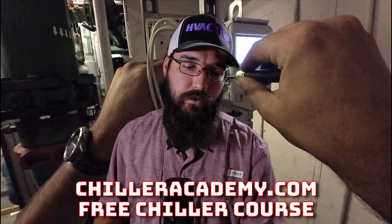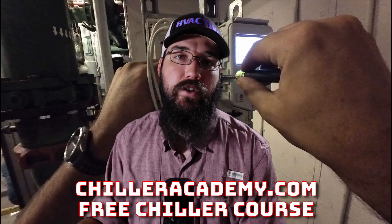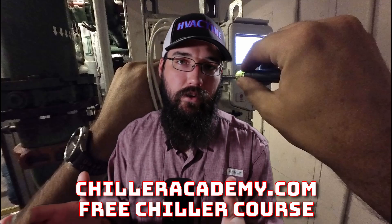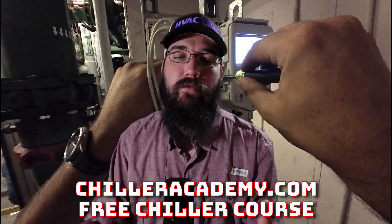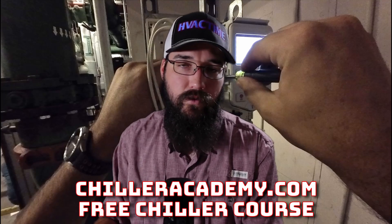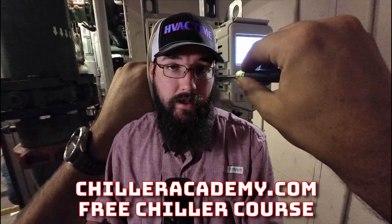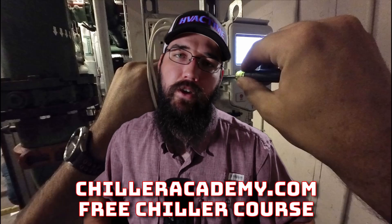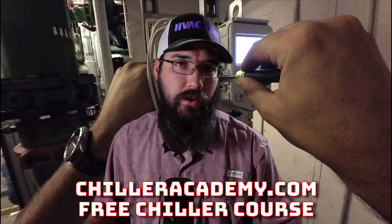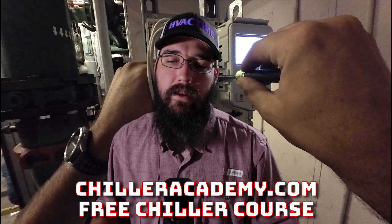We have to be mindful of that. If you're the commissioning tech and you set everything a certain way, but you come back after the automation team is done and see it's been changed — don't just jump the gun and change it back. They very likely had a reason. At minimum, ask questions. I'm not saying they're always right, but start a conversation rather than just reverting it. I've made that mistake before and you can get a whole plant out of whack pretty quickly if you're not careful.